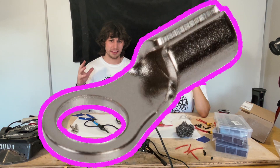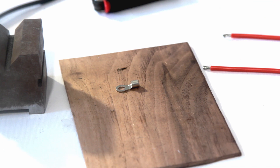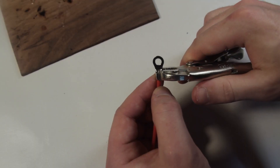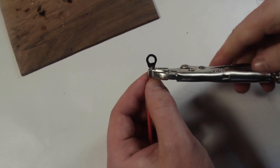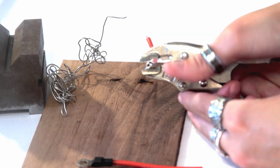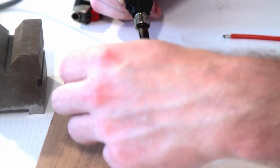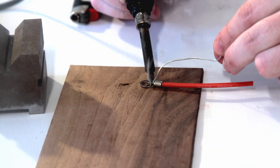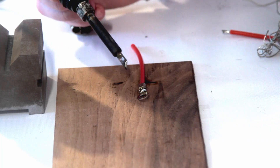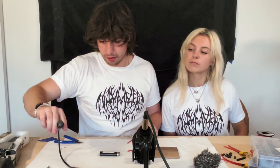Round three is the ring connector. This is your main connector for your red or black main power distribution. Typically with ring connectors people rely on a crimp to hold it in position, but this is robot combat — so we don't crimp it, we solder it. I come in with vice grips and clamp down, which lightly holds it in place when I go to solder. Then I bring in the soldering iron, hold for one to two seconds, and press the solder. I'm just looking to fill that up — the capillary action of the connector does a lot of the work. It does take a lot of solder though.